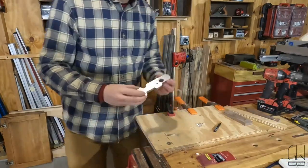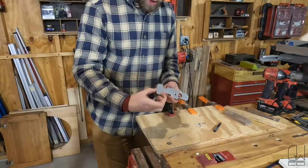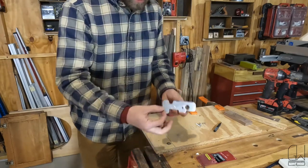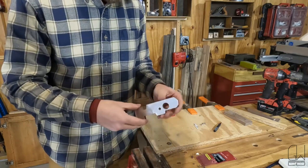So the way this is gonna connect to the camera is through this hole right here that connects to the tripod mount screw. There's gonna be a wooden handle that comes up here that's actually the grip. And that's gonna be attached with two screws. And then I'm gonna have three screws in addition to the Gorilla Glue that's gonna hold this wood and aluminum together.